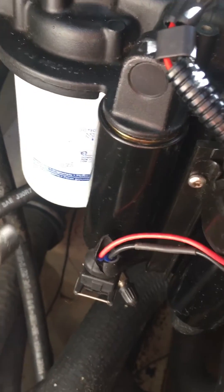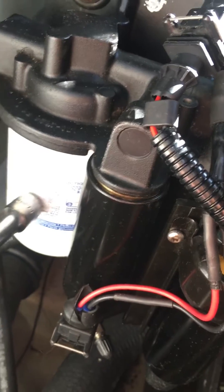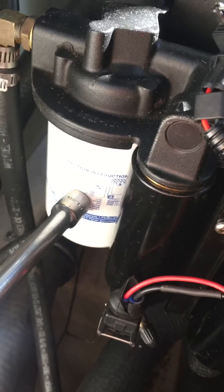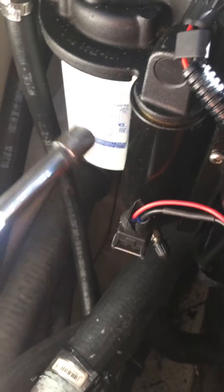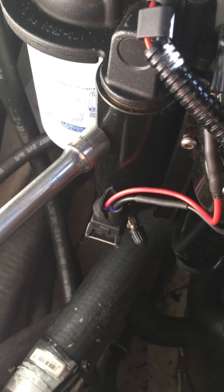So what you want to do when you put this pump on — you definitely don't just want to turn it on. The best thing to do is actually fill this filter with fuel before spinning it back on, that way you don't give this pump a very hard time. If you're going to leave this filter open and you just want to sacrifice and see if it runs dry for a while,